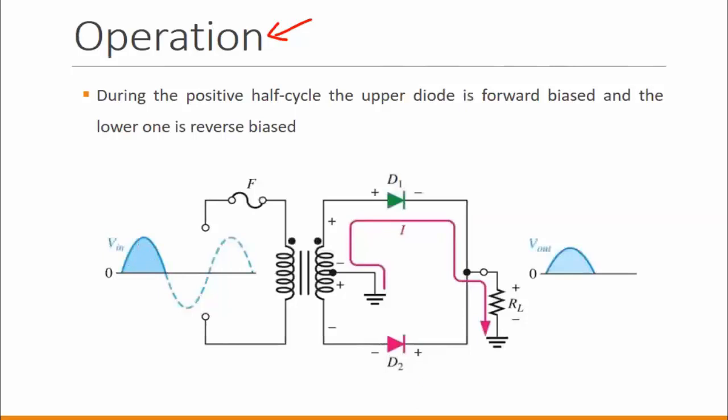So this is the direction of the diodes, both are facing towards that way. And that's how it will be phased. The top diode is the first half of the phase, the bottom diode is the second half, because the bottom part at that point has gone positive. So the signal right here, remember center tapped, one half of the signal will be in the same phase as the original signal. So if the original signal is like this, again, we are not talking about how much voltage here. We are talking about the shape of the signal only. So for example, if this is my input signal, this is exactly what my input signal is, with respect to the phases of the signal.